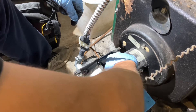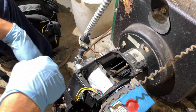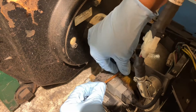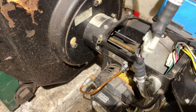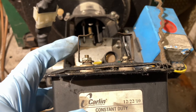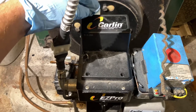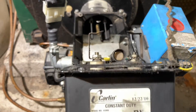Get the retention head back on — it fits perfectly, no guessing. Push it down and tighten it back up. Now we're going to put the burner assembly back in — remember, upside down first — and rotate it as we go in. It only fits in one way. Put the lock nut back on, again hand tight, then reconnect the copper line. I like to make sure I can go around at least three times by hand before using a wrench. We just want to make sure the electrodes are sitting on top of our spark igniters with a little bit of spring.